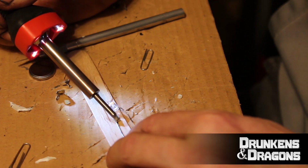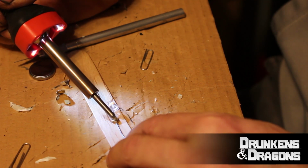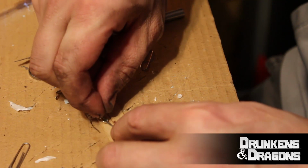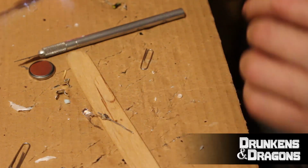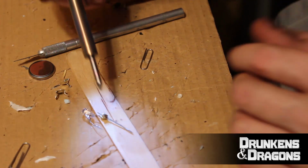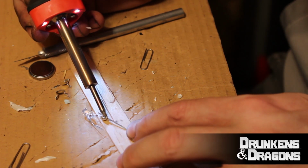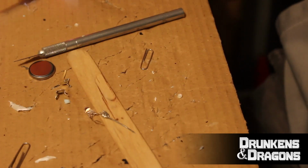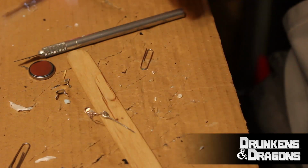get in, tiny bit of pressure. It melts. Place it right there on the joint. This is micro level welding, basically. Here you go. Get your gun lined up. Hold your piece. Contact and melt. Let it be. If you do one teeny little piece on each side, you'll get a fully encapsulated solder, so the solder will go all the way around the joint. Okay, now we're going to do this on the other contact.